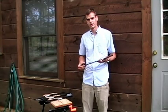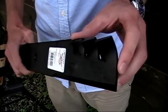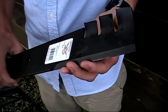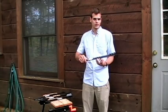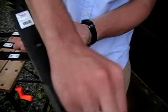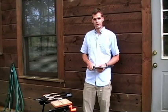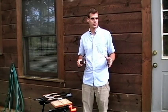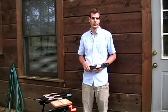The fourth blade I have here today is a little different style. This is what people call a gator mulching blade, or just a gator blade. You will notice here on this blade, the lift is divided into three segments that are kind of sharp. The purpose of this kind of blade is, like it is called, it is a mulching blade. So when it pulls the grass up into the deck and cuts it, these fins on the back are going to cut the grass again and again as long as the grass stays in the deck. When it is thrown out, it will be in smaller pieces than it would have been had it been cut with an ordinary blade, which means it's going to be less visible in your yard, it's going to break down quicker, so it's going to look good and also turn to fertilizer for your yard much more quickly.